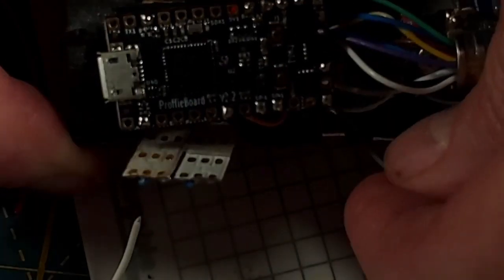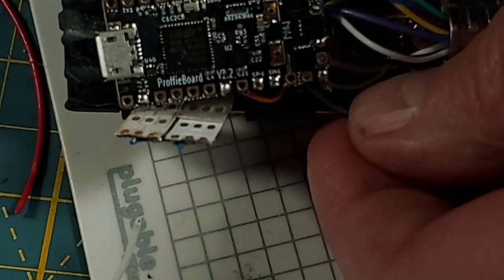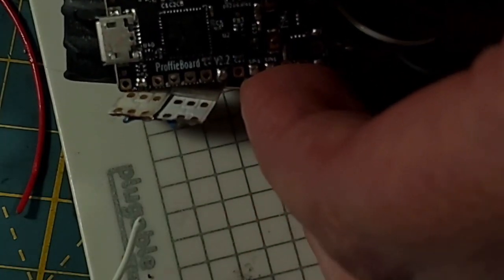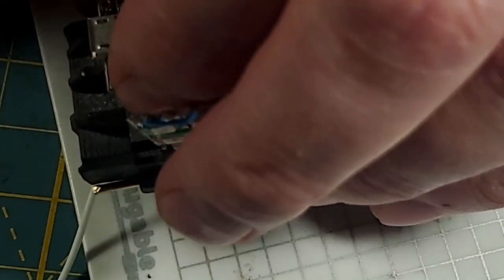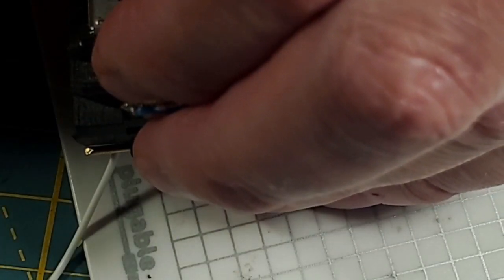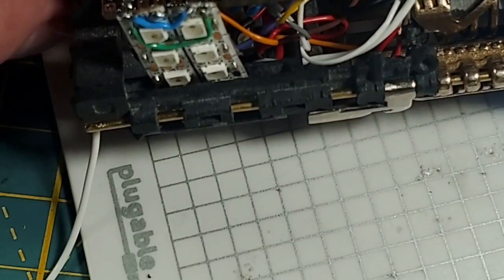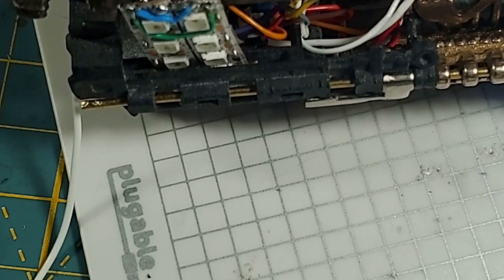Now our last wire for the install is this Neopixel data gray, which I'm going to try and push through the middle here to get it over, and I want to route it outside of, inside of this purple wire, like that. And this is data 4. This is the data for our accent pixels, and I want to leave enough slack on it to push it through the chassis when I put the soundboard into place. This is 30. This is our gray, which is our Neopixel data